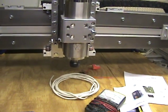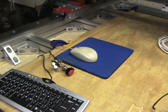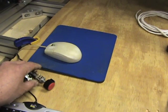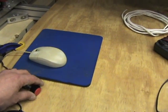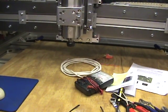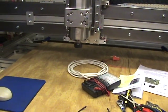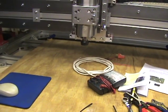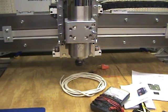What I'm thinking about doing is making a separate little setup box that's kind of mobile, with switches so I can set it to manual or PC control. I can even control the RPMs of the spindle — for instance, if I'm setting up for working on a piece the first time, I can play with the RPMs a little bit and get the speed correct for the feed rates I have set up in the program. That way I can establish what RPMs I need to use, and if I want to repeat the program I can key them into the software.